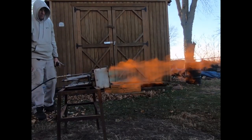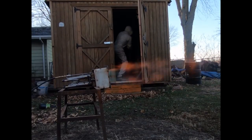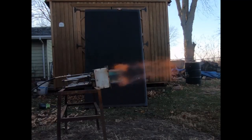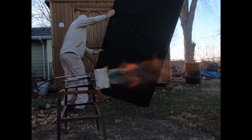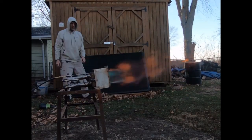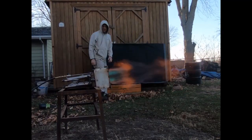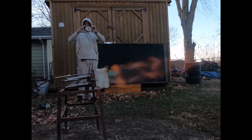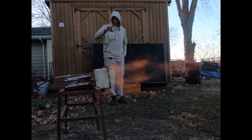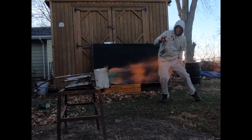So in this test, the main reason for doing it was to observe the effects of moving the six barrels forward five millimeters, because at lower settings we were getting too much backburn back towards the plumbing and some of the thread sealant was getting burned up. So we've moved it forward and now it's generating a very strange oscillating pattern, like some kind of shock diamond effect — almost trying to put out shock diamonds, but not quite.